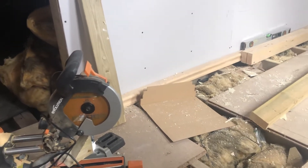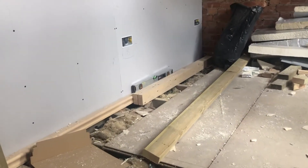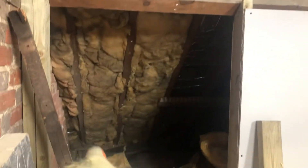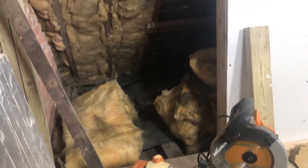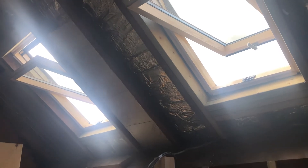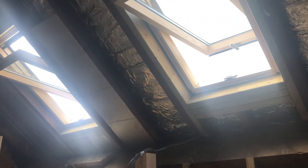We'll do a separate video on the steels. The house was renovated from clear so it was really easy to do. You can see the purlin there — we've stud walled and got some openings in the eaves. We've taken all the old insulation off, which building control is happy with, and put it into the eaves which will get boarded up. We've got two Velux windows — about 400 pounds each — and it took one person one day to install them.